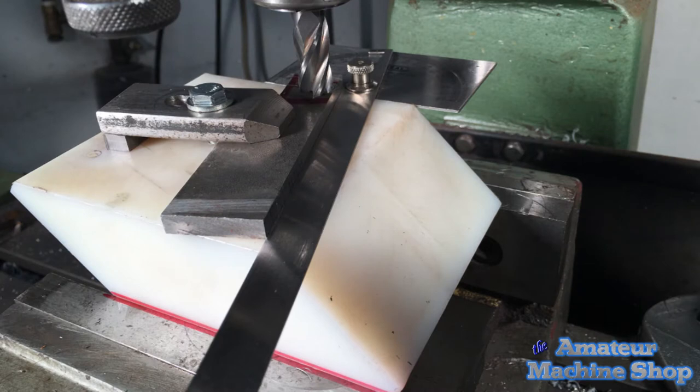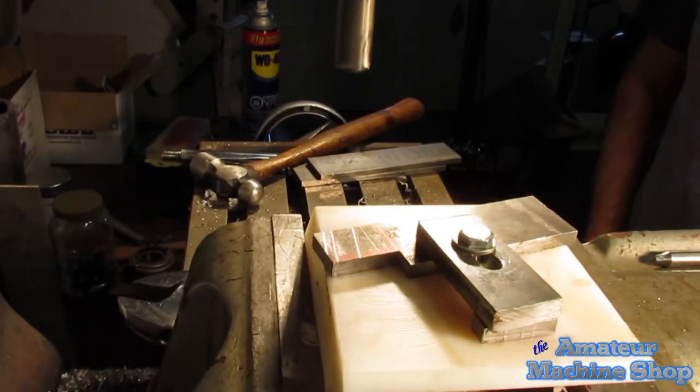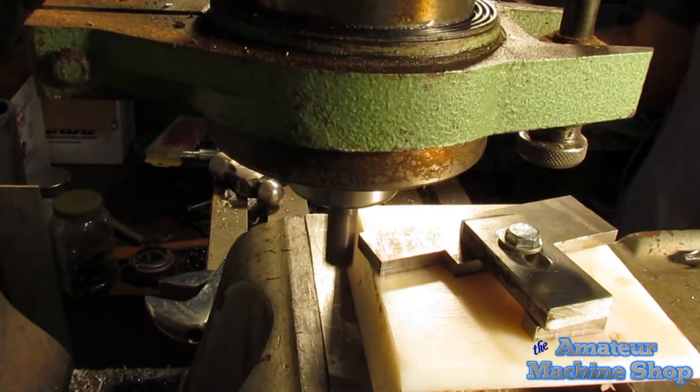I took very much the same approach to making the clamp for tool 1 as previously shown on the clamp for tool 2. The block was set and secured at a 16 degree angle. I proceeded by milling the end angle and then the slot that is 50 thou in depth.